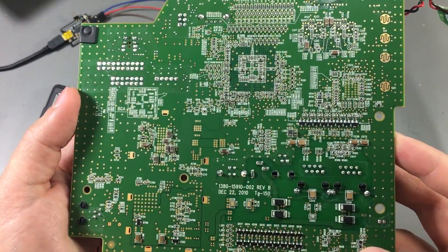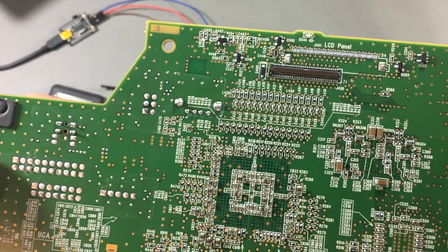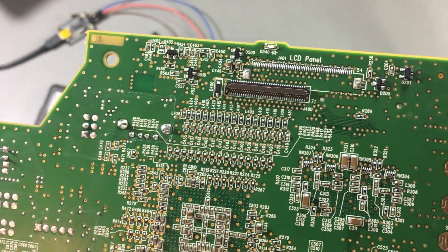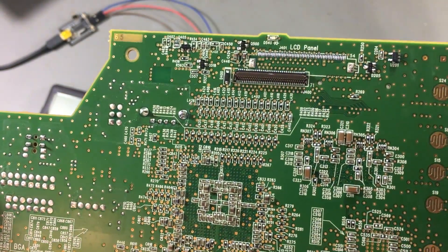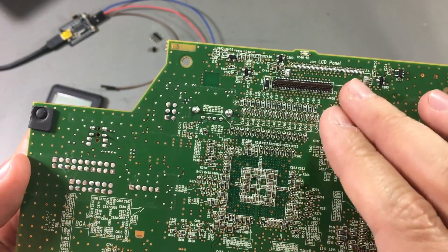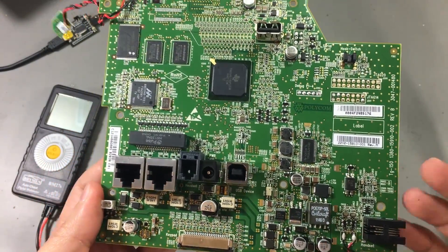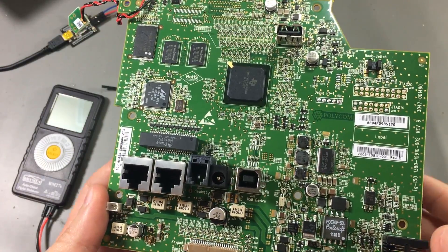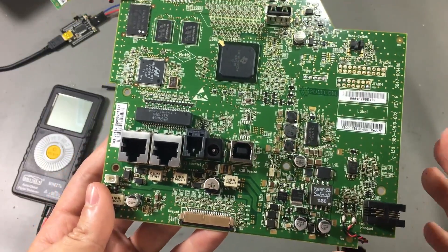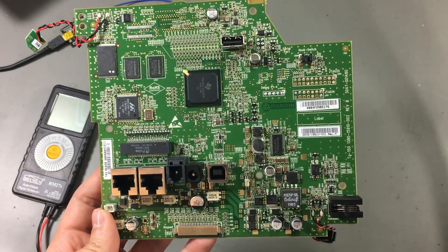We also have a specification for the substrate of the PCB which is TG150. A bunch of passives are placed on the back, mostly the coupling capacitors, and the LCD connector is also on the back. It looks like they've provisioned two footprints — maybe they have another model with a different LCD panel and are using a single board for both models, just populating a different LCD connector. I don't know much about the Windows CE bootloader, so I wouldn't know how to interact with it or make it show the desktop instead of the default app. If you know something, maybe leave a comment below and I'll try that in a future video.